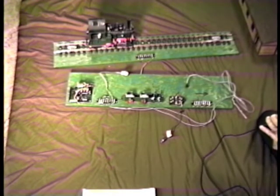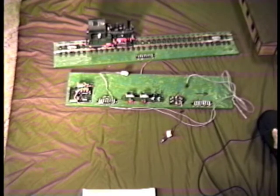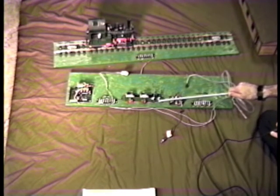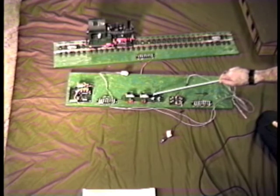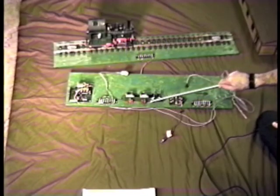One more thing: these two indicator lights. I always like to have some kind of indication that units are receiving AC power. With the magnetic type blocks and the 5094 semaphore arms, you've got red and green lights in the semaphore arms showing AC power. With this unit there's no semaphore arm, so the forward light indicates the unit is receiving AC power — when turned on, this light will be lit. The second red light indicates the unit is in the red state; when activated, this red light comes on, and when it times out and returns to the green state, this red light goes off.